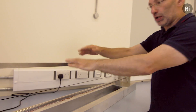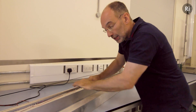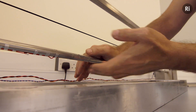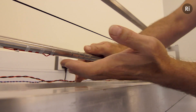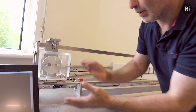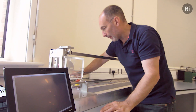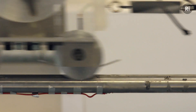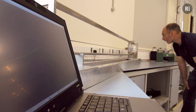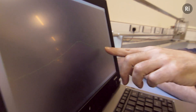Here's my model bridge. This is the bridge itself — it's a steel bar, and when I force down on it it deflects downwards and the bottom of the bar goes into tension. I've got a strain gauge fixed to the bottom of the bar that measures the tension — that measures how much load I'm applying to the bridge. Here's my steam engine; it's just a trolley that I can move across the bridge. Here's the trace from the strain gauge: it starts from zero, builds to a maximum when the train's in the middle of the bridge, and then drops back down to zero.